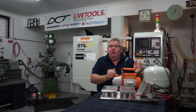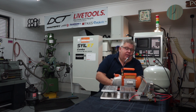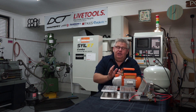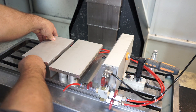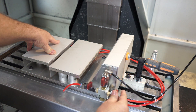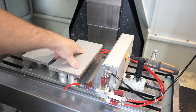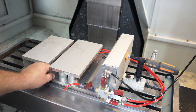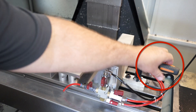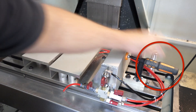It looks a little bit ugly — it's got more valves than a Russian submarine — but it works, it's functioning. What I can do now is turn on the main line to vac down the smaller plate straight away, turn on the second valve to vac down the bigger plate, and to hold the right angle plate I just use a quick-action bar clamp that I've cut down and adapted. One turn and that locks it up, cycle start and I'm away.